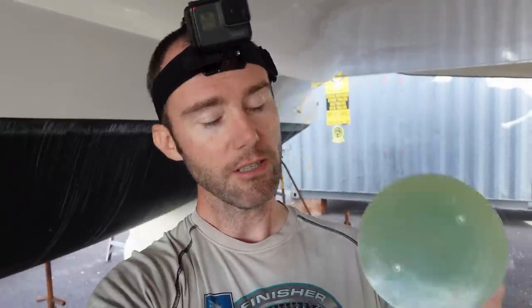There's one other thing I'm going to do — I did drill all the way through and tap all the way through the backing plate for the machine screws. Because we're going to be using the kitty hair from the bottom, I don't want that to fill up the entire screw hole. So I'm going to put a little bit of epoxy on the backside just to prevent things from coming all the way up. It was just easier to drill and tap the whole thing at once. Let's get the big hole drilled.